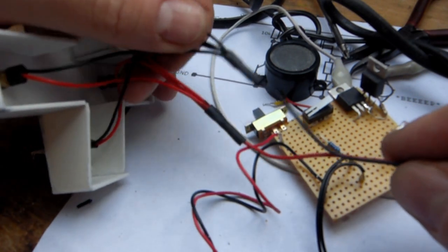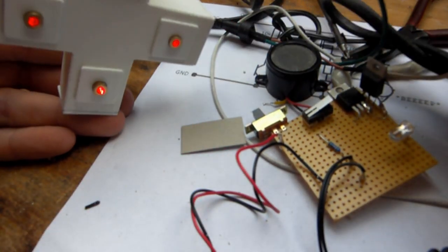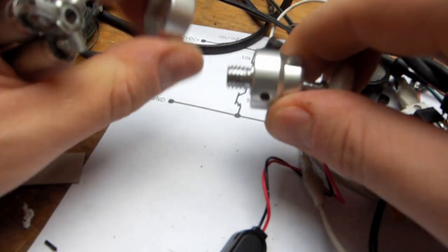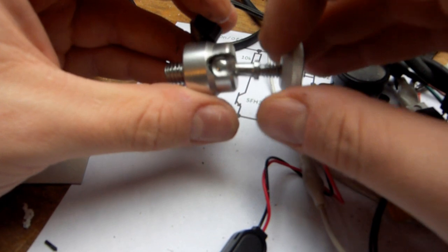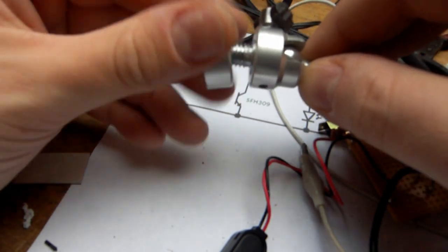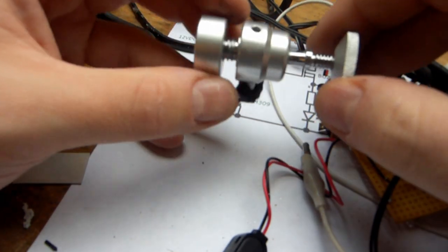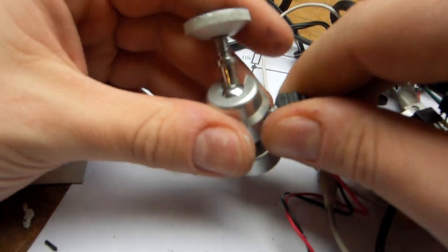All plus and all minus LEDs wired together. Shrink tube. Yep. Looking good. And for the joint in the middle, I used a tripod for cameras, and we're just gonna put one end in here, 8mm hole, and we will use this as the nut, and a 5mm, 6mm hole in here, and then this on the inside should work just fine. And then we have a flexible head.